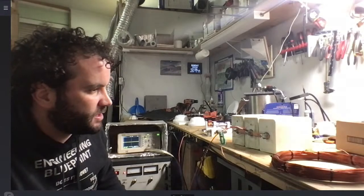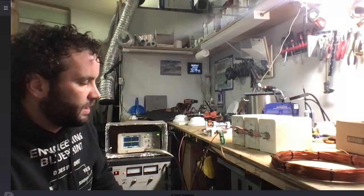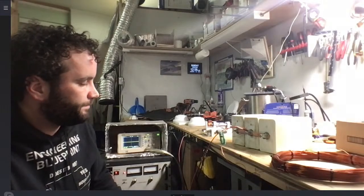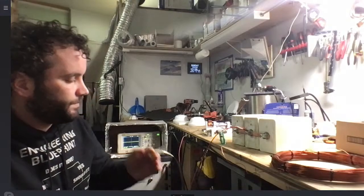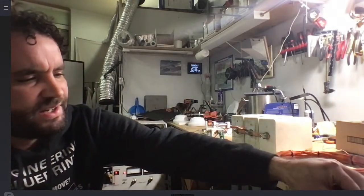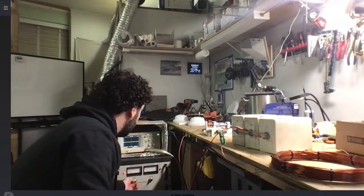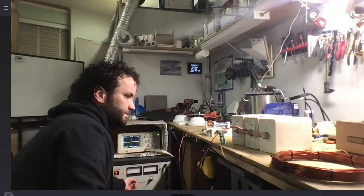So I am seeing some sparks over here. It does not seem to be going into reverse. I was just charging up, getting a spark, and that's it. And down on the scope then? I didn't watch your scope waveforms, but if they're not going in reverse, that's very, very good. That means your supply is at no threat of being damaged, and the rectifier is working great then. So hooray for you. You can run that test all day. It might not be good for your coil, but it's fine for your supply.